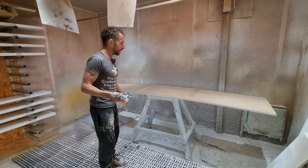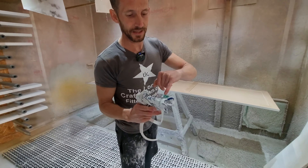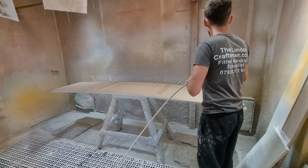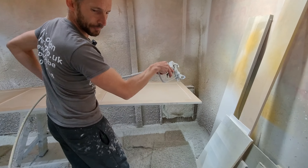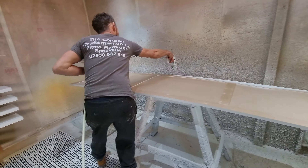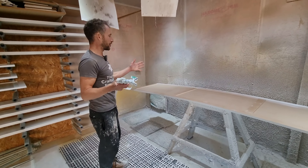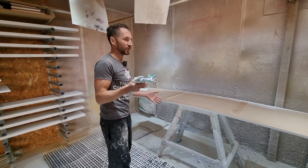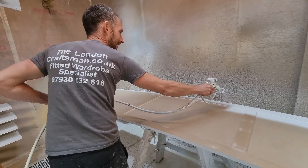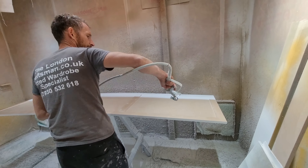So what I generally do is I hit the back edge first. We're using a 310 fine finish tip. So just going to hit that back edge — I've only got a five metre hose so it's just a little bit tight when it gets to the end. So next thing I mean you could play around with what you want to do, but I generally just give it a hit here, trying to aim directly into that corner. Go at a constant speed, don't change your height. Let's go for these shorter edges.